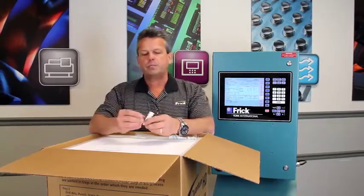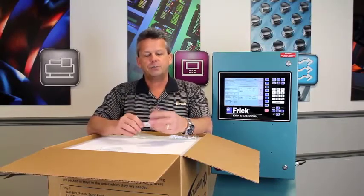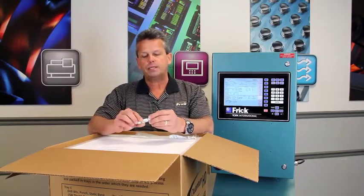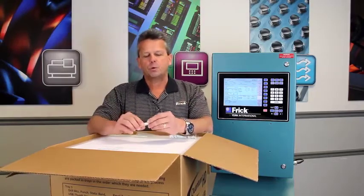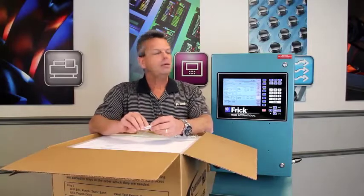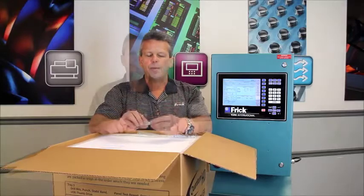We also provide you with a USB flash drive. On the flash drive is an instructional video that tells you how to go through the process. If you're upgrading from a Quantum LX to the Quantum HD, you can use this thumb drive to both save and restore set points. However, if you're doing a Quantum like we are today, set points have to be manually recorded and restored because the Quantum used a DOS program while the Quantum HD and Quantum LX used Linux, so there's a compatibility issue.